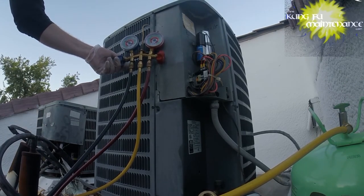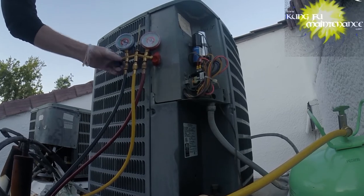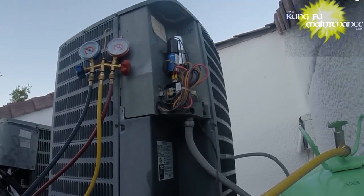I'll go ahead and turn this off and take a look at where we're at — 49 on the low side. I usually like to see this at 40 on the low side, but that wasn't cold enough for this one. Definitely the high side is more accurate. When we did have this hooked up it was too low. Sometimes it takes time for it to shift from the low side to the high side — this needle will really slowly start to go and adjust. Feels pretty good there. Here's the 45/5 and I have a hard start kit.